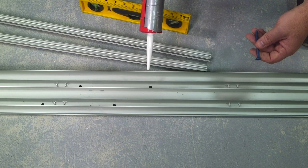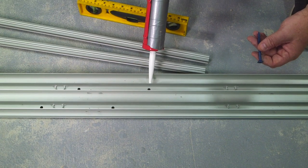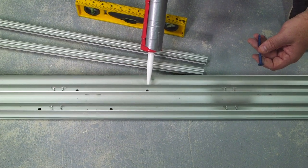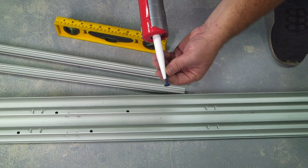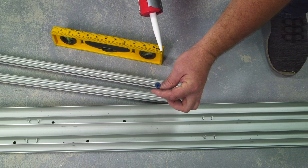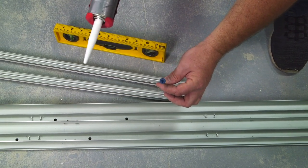At the bottom of your mainframe track, pre-drill the concrete through these pre-drilled holes, vacuum out the concrete dust, fill each hole with your appropriate sealant, run your fasteners through the tube of sealant, and then run your fasteners down in that hole. After inspection, cap off the top of your heads with more sealant.